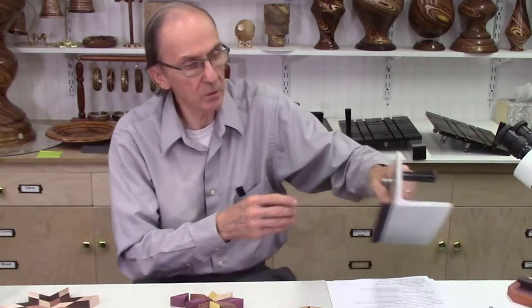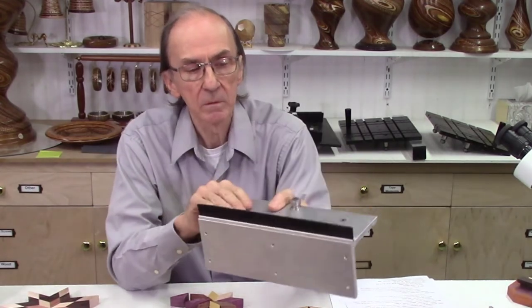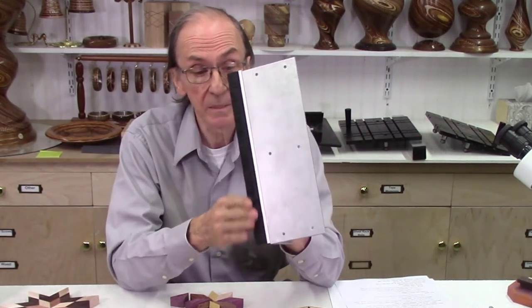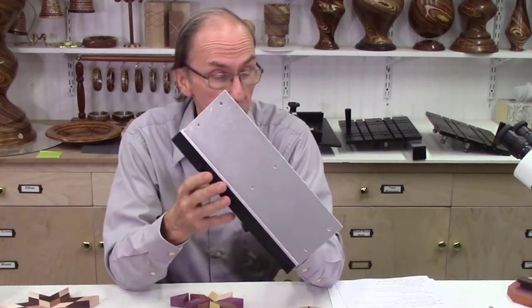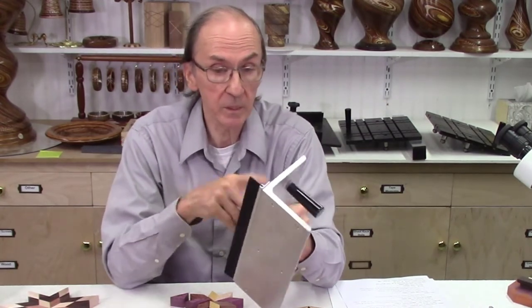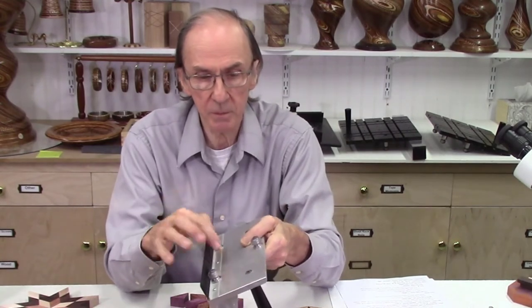I just finished this today — I took one of those brushes and mounted it on my carriage. It's all set to run and I'll be testing it in the near future and doing a video to determine how well it works. If you want to do this yourself, you can buy this brush from your hardware store — it's not that expensive — and you can easily mount it yourself on a sacrificial fence or directly on your carriage. It is important to keep your roller bearings clean; if they get clogged with sawdust, they can crack and you will need to replace them. There is a video on our website describing how to replace the roller bearings on the AccuSlice system.